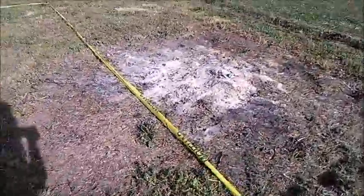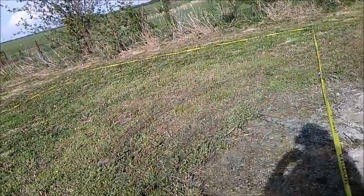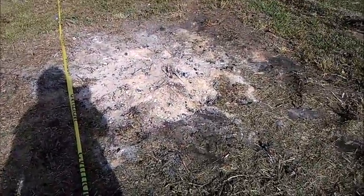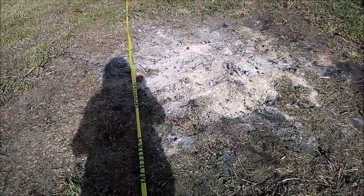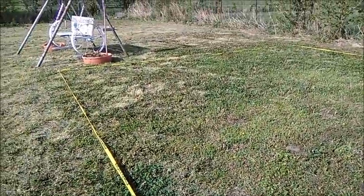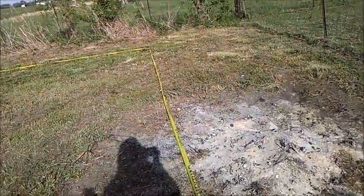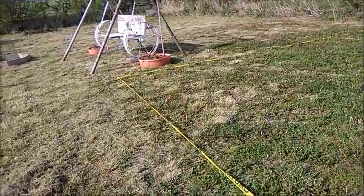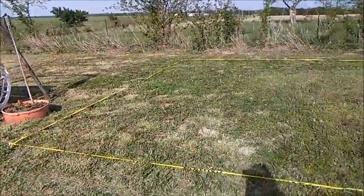All of the post locations have been measured out. If you look it looks pretty square and in line. Remember these are tent stakes, but it's going to be five by five posts, so when we dig where that tent stake is it'll be a much bigger hole. This will get cleaned up probably Wednesday — I might do it tomorrow night. My five by fives are sitting at the lumber yard; I just have to go get them. Wednesday I plan on digging holes and getting those posts set. The quicker I get them set, then I order the trusses, start putting up headers, and it'll be a little frame of a house. I'm super excited!